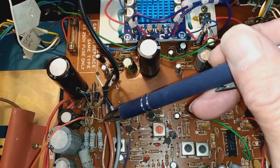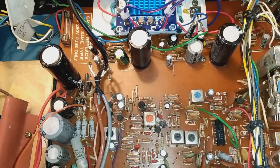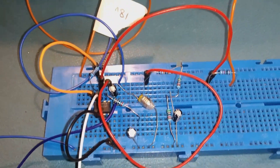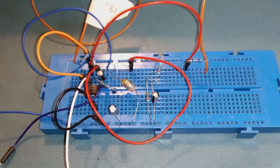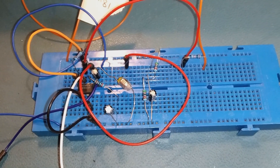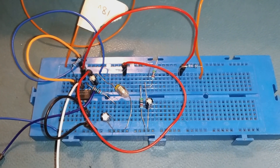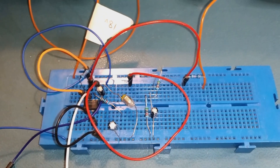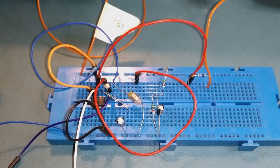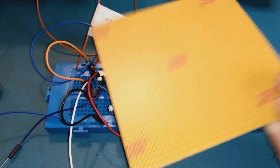These two wires are screened leads which go onto a couple of wire wrap posts on the board. I've disconnected one of those and routed it through to a little breadboard circuit I've knocked up. This is using an NE5532 op-amp. I think I've set it up with a gain of about six — there's a minimum gain these op-amps need, at least three anyway. With a gain of about six, it gives it enough drive to actually power the amplifier properly. The next stage is to build this preamp onto a piece of Vero board.